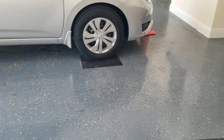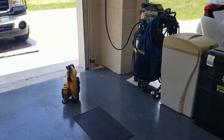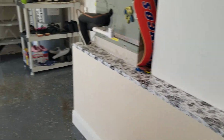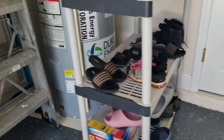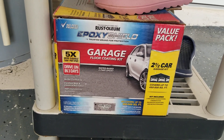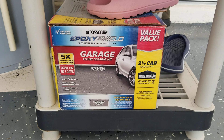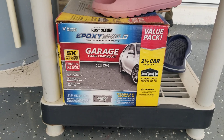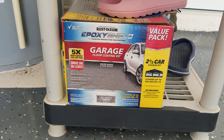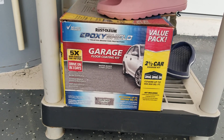If you want to try this, good luck to you. I will mention the second time I mixed the packages together — I used my drill. See, there's no mistake about what I bought. I bought two of those. The first one I mixed it up the way it tells you to, running from A to B on the packages, which I did. I prepped the floor very well — it was all brand new. So it wasn't the prepping of the floor. In my opinion, it was the mixture of the epoxy with the paint.